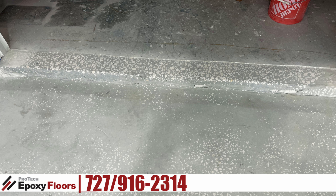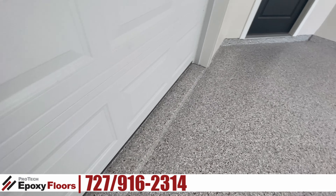So this is what our prep looked like in this area before we did the final chips and epoxy. What we did was cut a keyway in along the doorway and made it level with the floor in the back. It was very difficult to actually grind this because there wasn't much depth to go in and drop it too much. Also, as you can see, this floor — once you got off the cap — was very, very strong. You can see all the aggregate in here; this was a really nice floor. We put that keyway in so that when it gets driven over, it's flush with the back garage. After removing all the material, we dropped it down on the front about a quarter inch or so. So this is going to be a really strong lead-in edge into the back garage, which is going to be very functional. This really turned out nice.